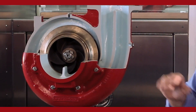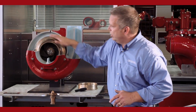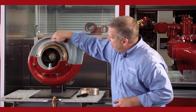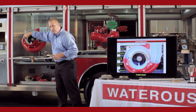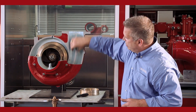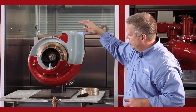The other thing we're creating at the end of that volute is called the stripping edge — it's a knife-like edge which cuts the water off of the impeller as it rotates. We have high pressure on one side coming around getting cut off on this stripping edge. We have another volute that starts and comes around, getting cut off on this stripping edge. The two discharges come together at the end of the discharge flange.